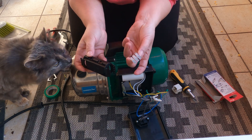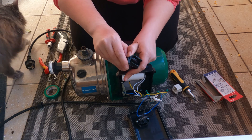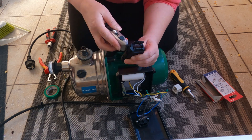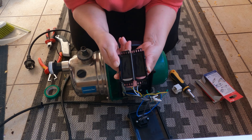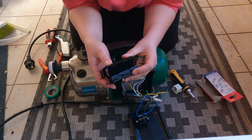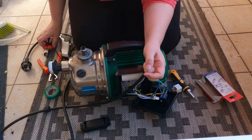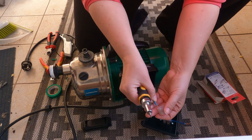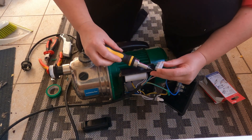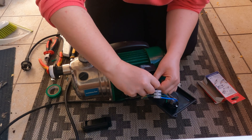For this reason I bought a gel box. This box enables your connections to stay insulated and protected from water, so you have no fear in a wetter environment. It came with the usual connector and an insulation box that you clip around it. I started connecting the two, using the same procedure — I snipped out the parts I had already combined, stripped the insulation I needed, then took the connector and connected the wires one by one so that the correct color is matched to the correct color to make sure the pump works correctly.